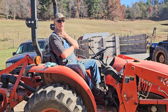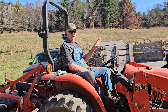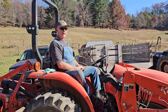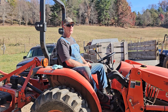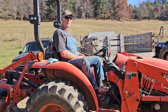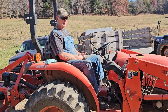The rest will be what they call secondary wood — that's something that's been done since furniture has been made. They kept the best wood for what is visible and used a secondary wood like pine or poplar for what's not seen — drawers, inside, shelves. Poplar is a good wood and can be stained, but the grain is really tight. You can stain poplar to look like any kind of wood you want because the grain is virtually invisible. Some poplar is very colorful — I call it rainbow poplar, I've heard it called peacock poplar — green, purple, red, almost every color of a rainbow.